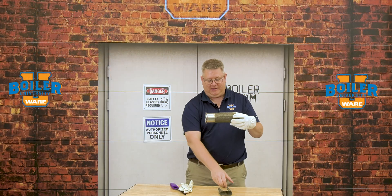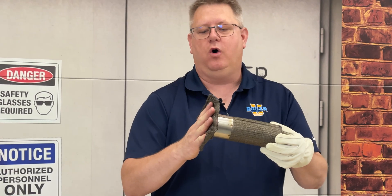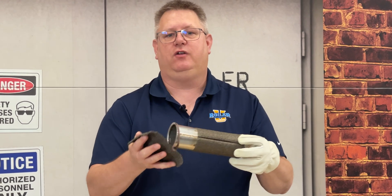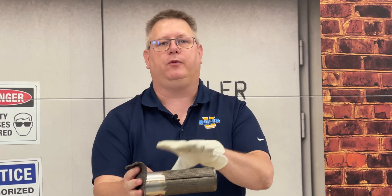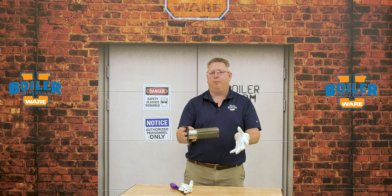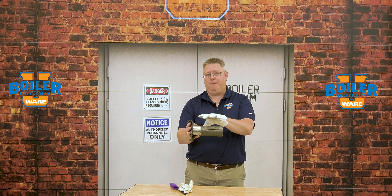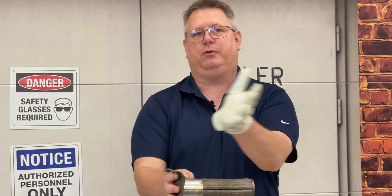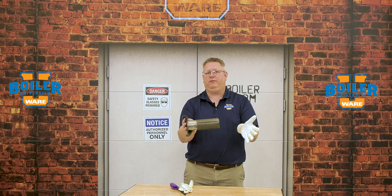Adding a second piece of material as a flame arrestor would serve as a backup to the primary burner, but the issue is we would have so much pressure drop going through multiple screens that it would be difficult to size the fan and the burner appropriately. So the answer is that a pre-mix burner is kind of like a check valve — it does the job, and if we add multiple check valves we're probably going to cause more problems than we fix.